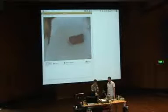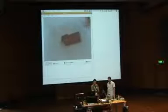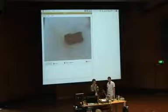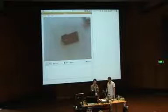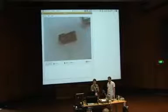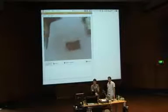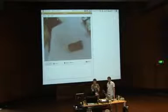The WizNet chip itself has all the Ethernet framing hardware, but also has a little microcontroller that actually runs the stack. The main advantage is that from a software standpoint, on the Arduino side, you don't have to run the TCP/IP stack on the Arduino, so you're saving code space and some complexity and compute power. The downside is you don't have quite as flexible an interface. You basically just have a socket style interface, so you can't sniff arbitrary Ethernet packets if that was something you wanted to do.